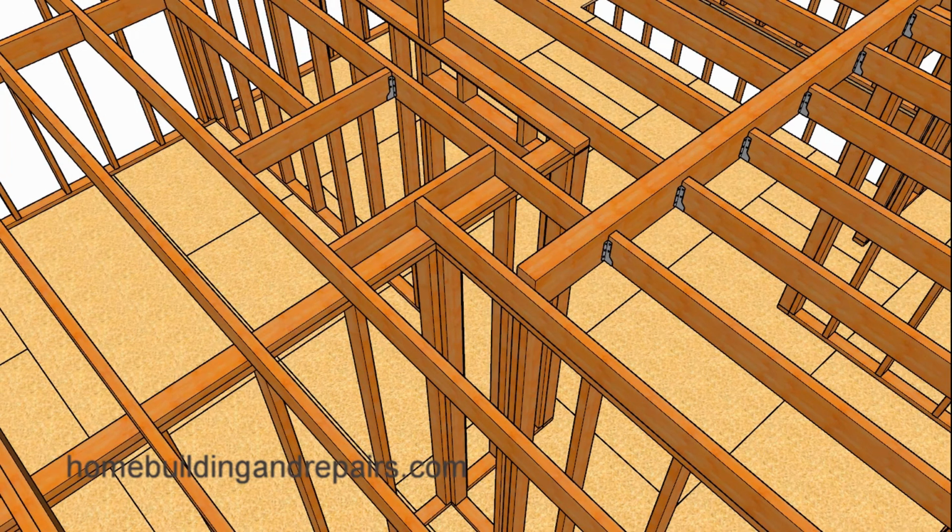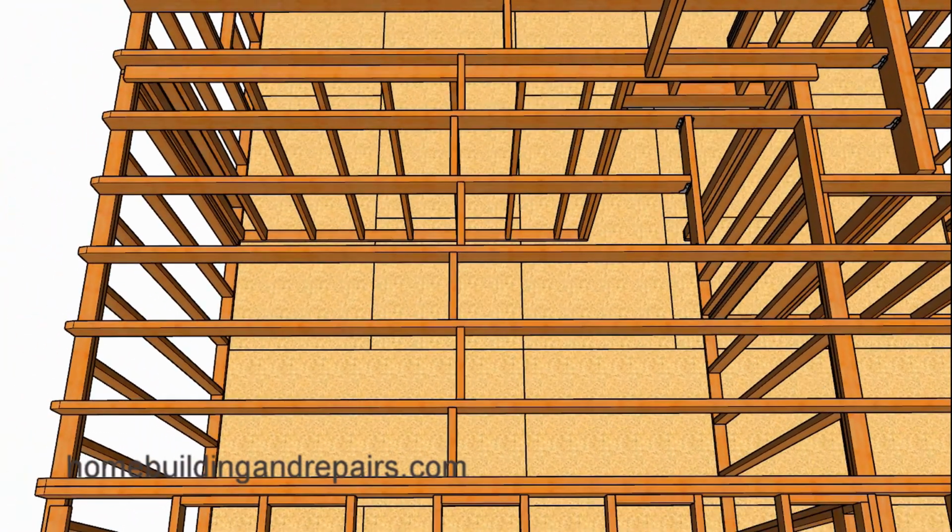And like I said earlier, if I was using a different roof pitch, something that was going to be a little steeper, then I could put the crawl space in the closets and keep it out of the bedroom here. And let's not forget, if I was going to move the access into the closet, that I might need to move it a little further away to allow for the shelving in here, or reduce the length of the shelving, which again is going to create design problems that you might not want to be dealing with.